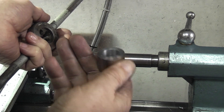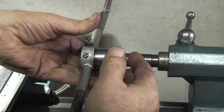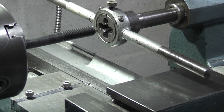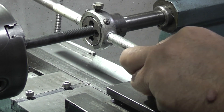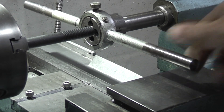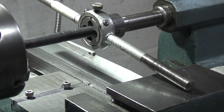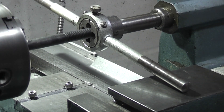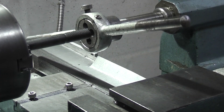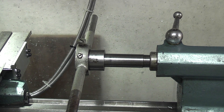That's just using a scrap of steel that fits onto your existing die stock holder. I've just placed a bolt in the chuck and fitted my hand wheel to the back of the head stock, so I can just bring the die stock forward, lock the tail stock, turn the head stock. Once it engages, all I have to do is keep feeding the tail stock forward as the die travels along. Once you're finished, reverse. Well that's the finished item — it's the quick way to use your die stock on the lathe.